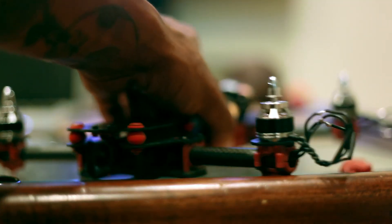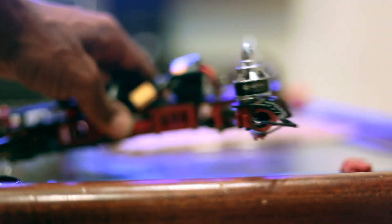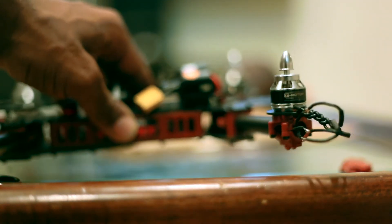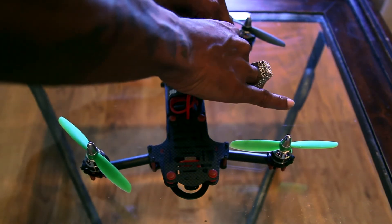After this process, I used the Vortex's integrated software, RotorSense, to set motor direction, allowing the user to flick the prop in the desired direction wanted. So no need to switch two wires if the direction is wrong, as shown here.